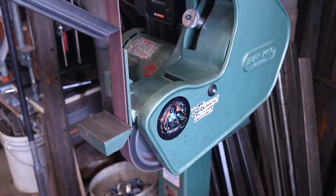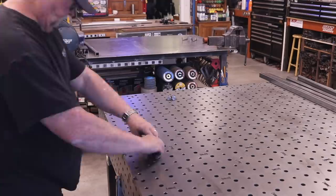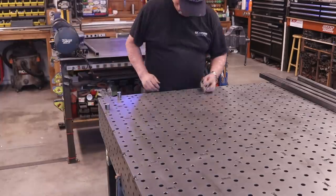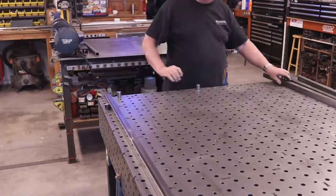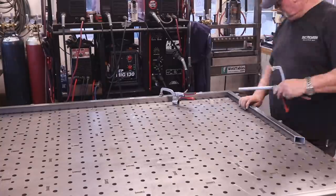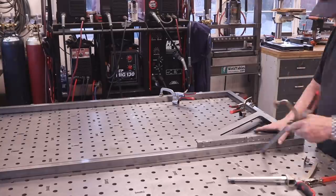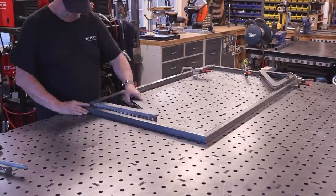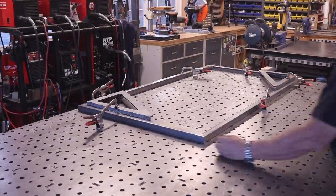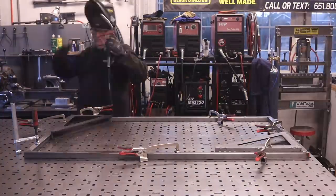Over at the fab table, I've made these little pins on my lathe and they work out really good. The table's perfectly square with these holes, and you can just pin everything up on either end like that. I clamp everything down with these fixture clamps and squares — everything is perfectly square. I've double-checked it, and all there is to do now is weld the thing together.